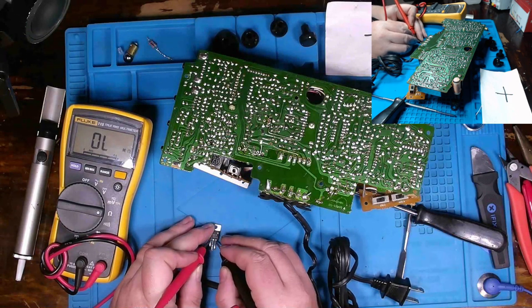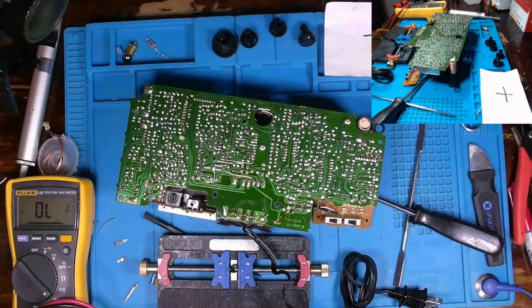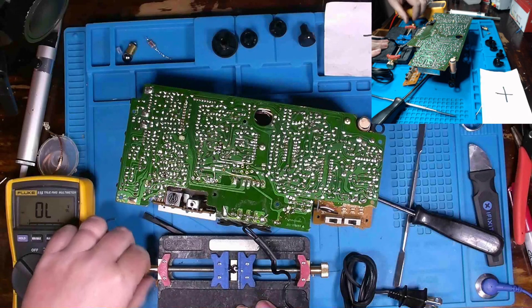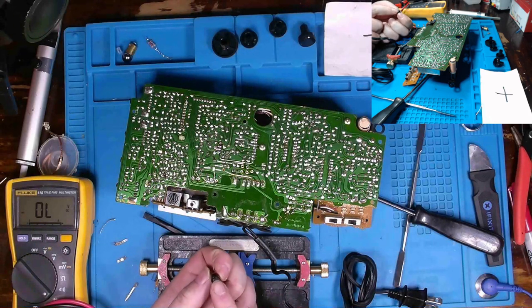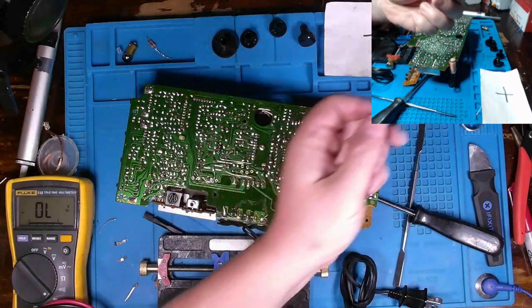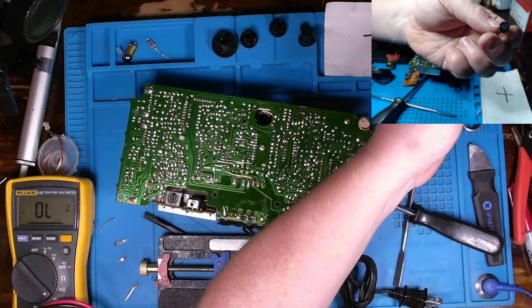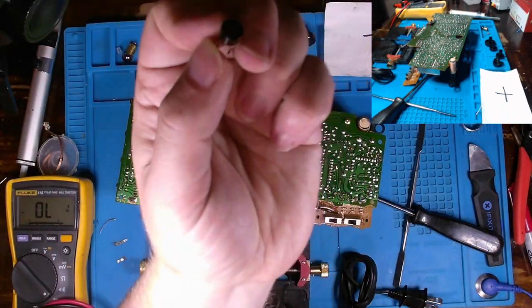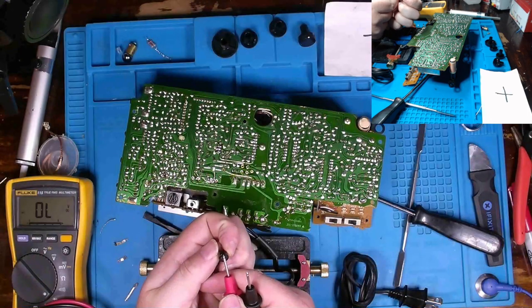And we are open and not biased with the lead swapped around, base to collector, base to emitter. Quick rectifier check before I move on to the capacitors. You see how we have the positive indicator right here at the top. Put that into the camera over here, maybe that will come through. But either way, positive is marked right up here.